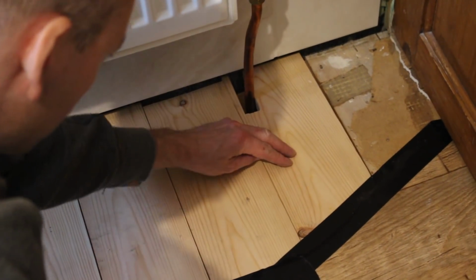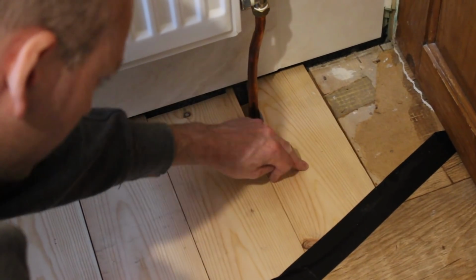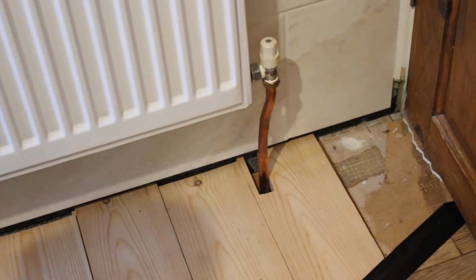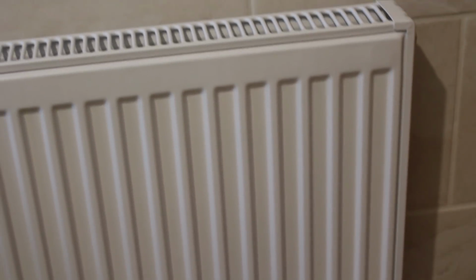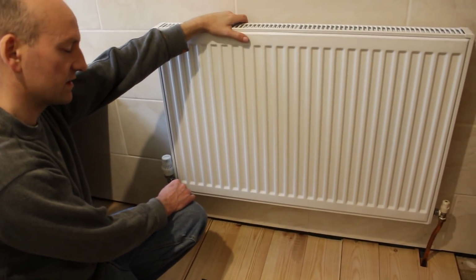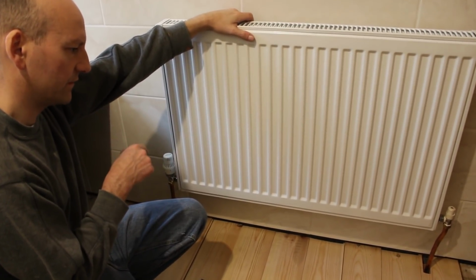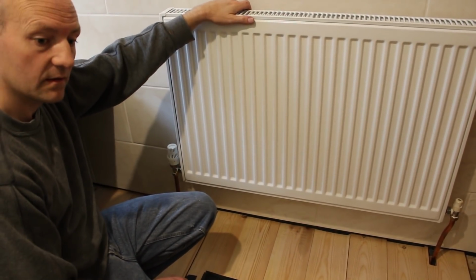So before, the Yorkshire joint was over here, but I actually turned it around, put another Yorkshire joint in, and obviously made this pipe up. This had to be opened more. It's a setting up valve to let more water flow in, and we ran it up to make sure there's no leaks, and the boiler is at 1.3, 1.4 bar, which is about 20 psi. 2 bar is 30 psi, 3 bar 45, so 1 bar 15. I ran it with just fresh water in to make sure there's no leaks for about a week, and that's fine.